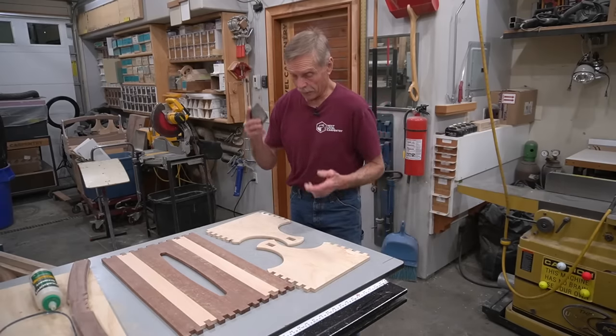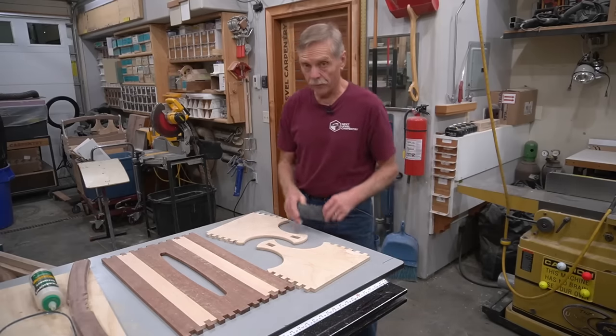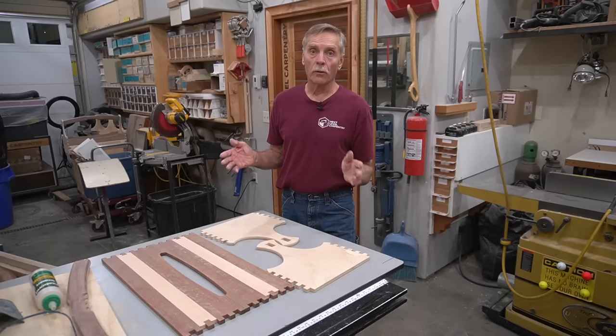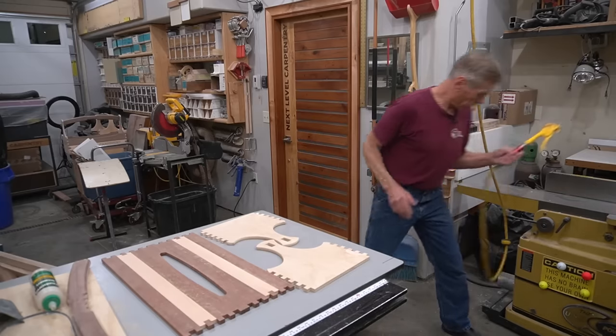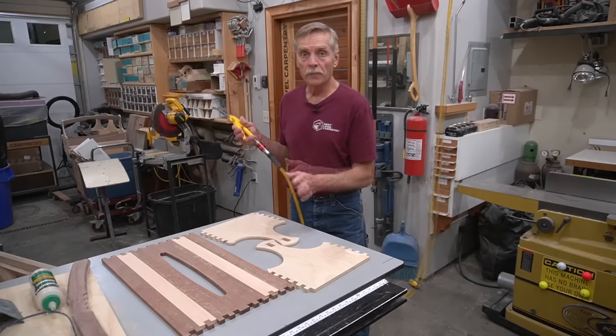So one last prep step, I sanded everything with 500 grit wet and dry sandpaper, so it's super smooth because I'm putting a gel poly finish on it. If I was doing a lacquer or a varnish, sanding to 180 is plenty. But that takes just a few seconds, and also requires that I blow the dust out of the pores of the wood before the next step.